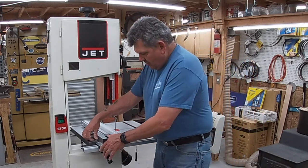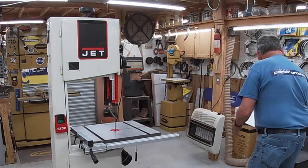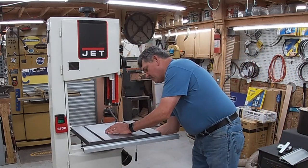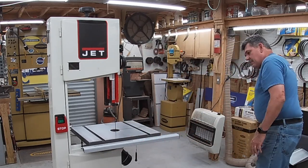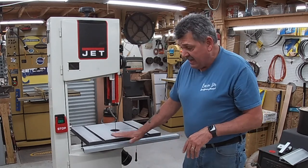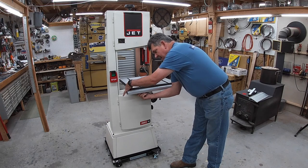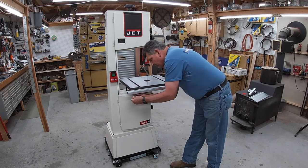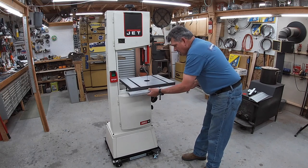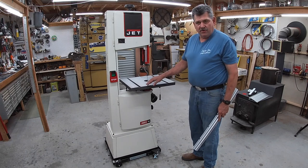In order to take the table off, it's pretty simple — just slide that over, loosen those up, and slide that fence out of the way, then slide that right off the saw. We'll take our table insert out. I'm going to take this rail off so that it's easier to see underneath there, and also to show you how easy it is to remove — should you ever need to. We need a 13-millimeter wrench; you don't even have to take the bolts out all the way, just loosen the four underneath here and that rail comes right off. Some folks don't like that rail sticking out, so it's easy to remove should you ever need to.